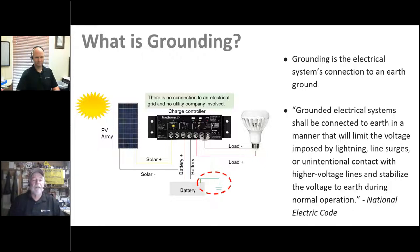It's important to note there's a difference between grounding for electrical safety and grounding for lightning protection. Safety grounding is employed to prevent electrical shock hazards by grounding exposed metal parts that may become energized due to various faults. Grounding for lightning protection is used on metal structures to dissipate to ground the induced voltage and current from a nearby lightning strike before it can reach damaging levels. A lot of this information is found in NEC Article 250, a very comprehensive article.